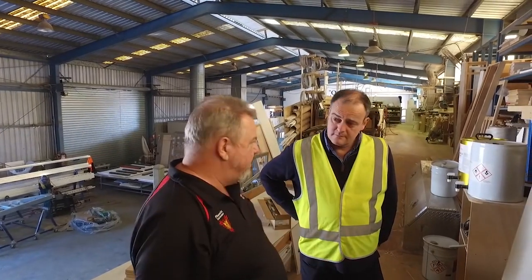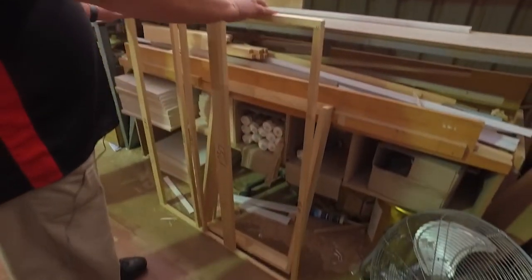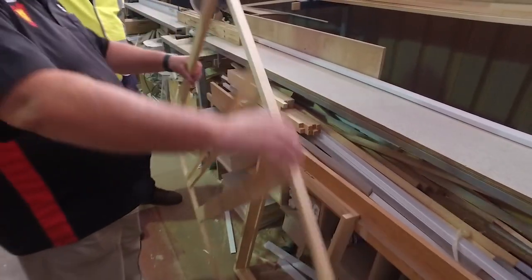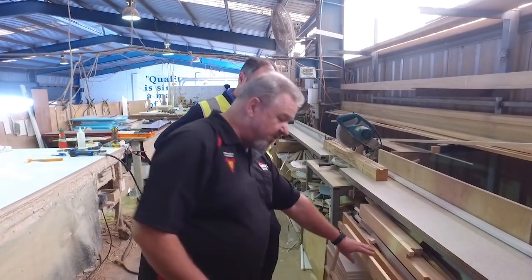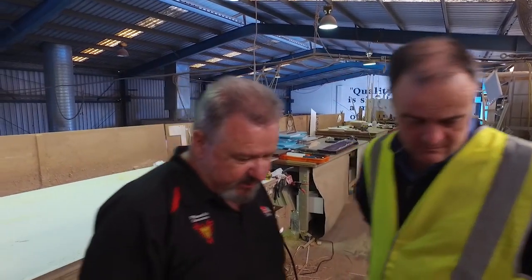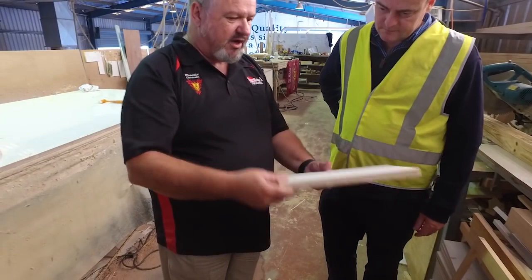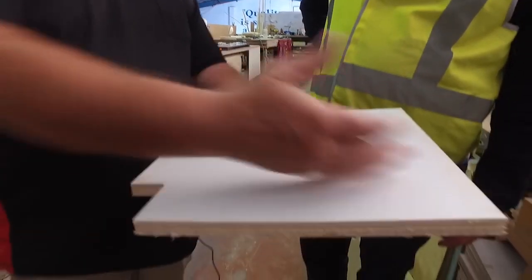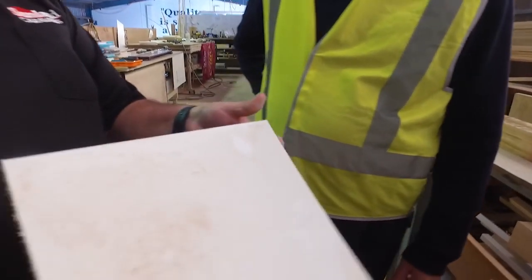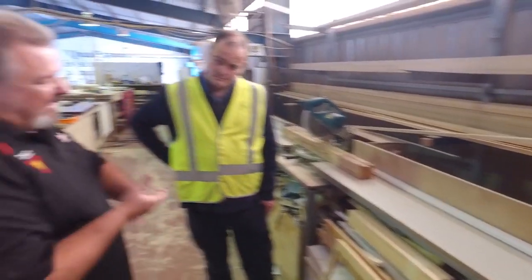When it comes to our furniture, we've got lots of options. Here you can see a traditional timber frame. This frame will then have ply attached to it, be routed out, and this is what most caravan manufacturers will use to produce it. In some ways this is a very good product — it's still quite light, very flexible, easy to produce — but has a lot of limitations on what you can do to it. So nowadays we offer a lot of other types of products, including a type that's more of a solid board. We can use a variety of different surfaces, coloured laminates, we can cut it out to various different shapes, and as a solid board it makes it easy to screw into and cut holes into.